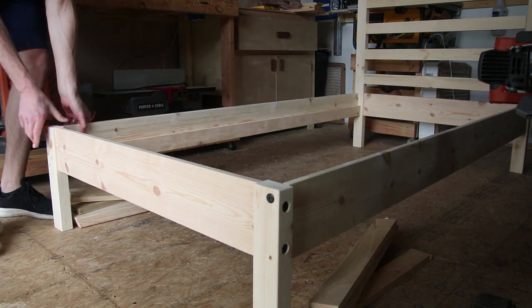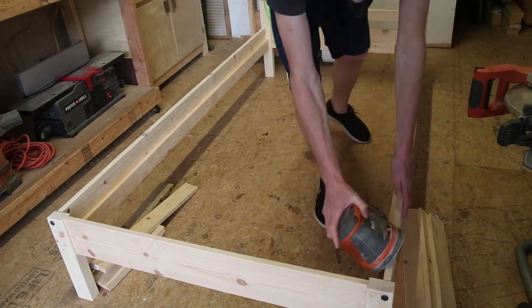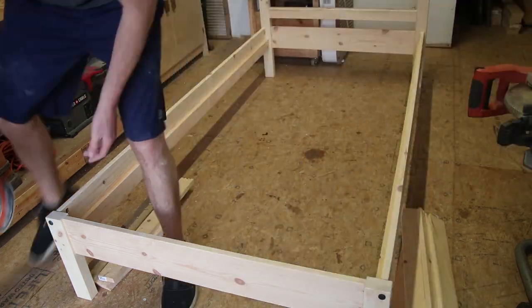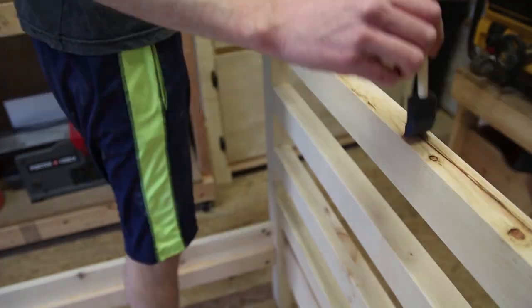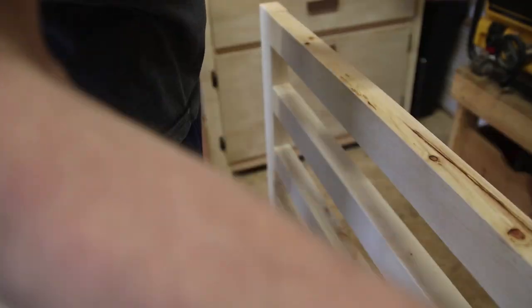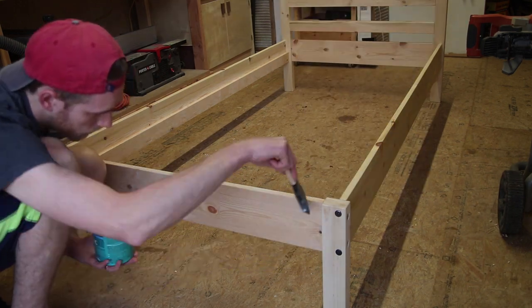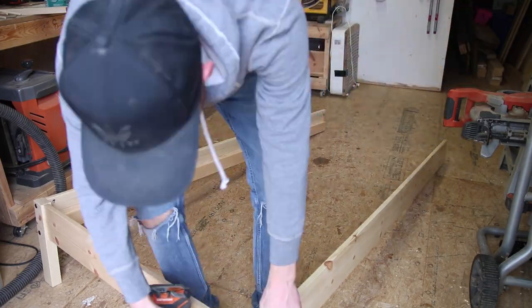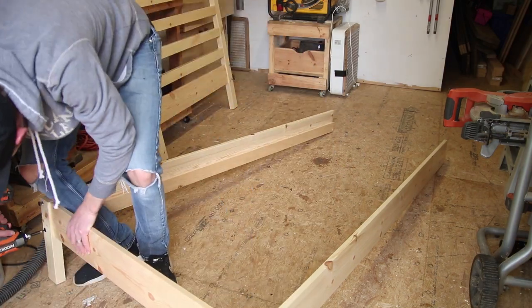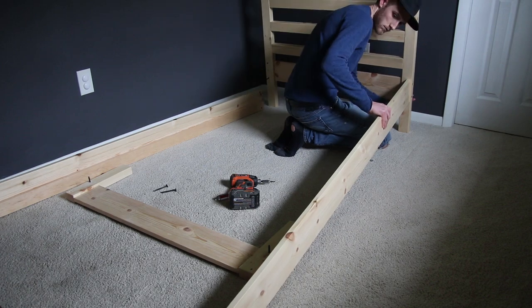So after I got the holes drilled, the cross dowel nuts all working, I put everything together and then I gave everything one final sanding all the way up to 220 grit, and then it was time to add the finish. I chose the polycrylic because it's a water-based and it dries really quickly. I use it a lot on my channel, so it's something that I just really have come to like. And then I took everything apart and then I could take it to the house for final assembly.